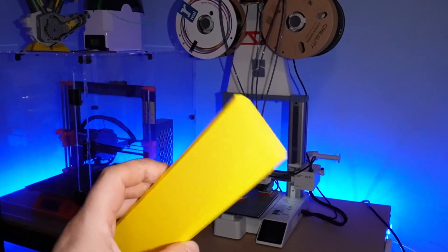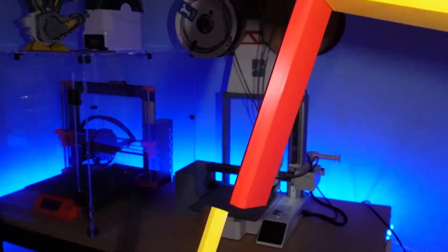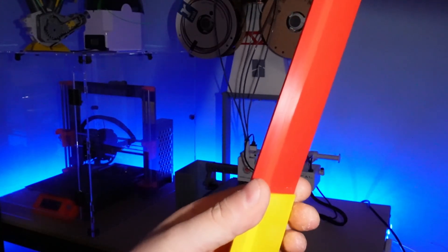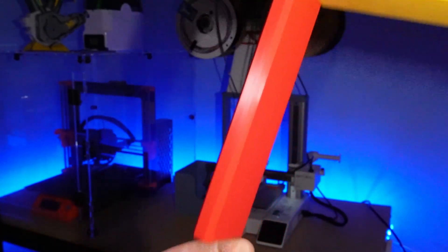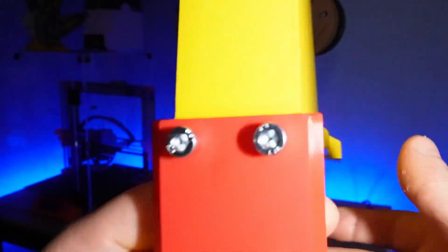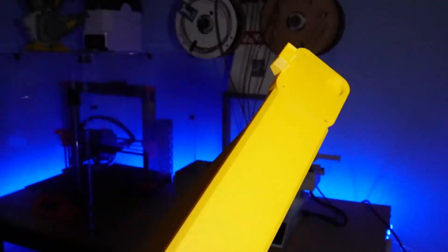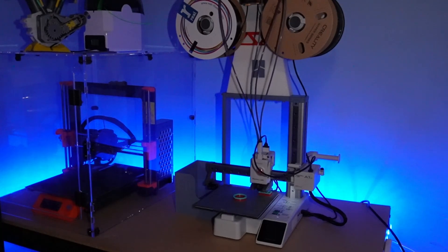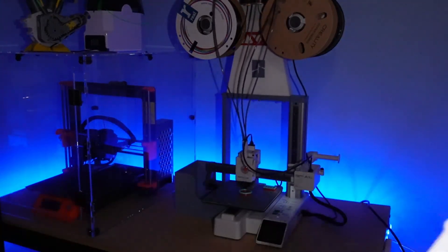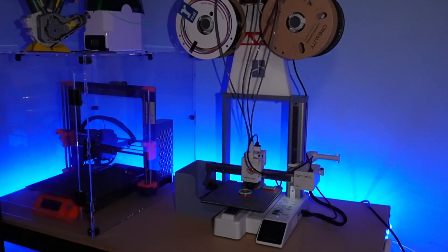Here are all the parts that you need. This one is a side bar — as I told you, you have to print it with connectors, and then it comes together like this. You push it in, so you have two bolts here, and on the finished version you have six bolts right underneath, which are all M5x25. The holes are made for it and the lengths are also perfect, so if you have M5x25 bolts lying around, they will fit perfectly.